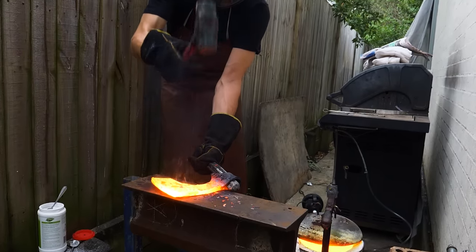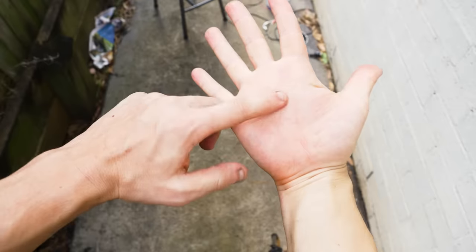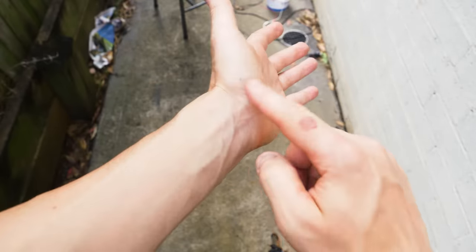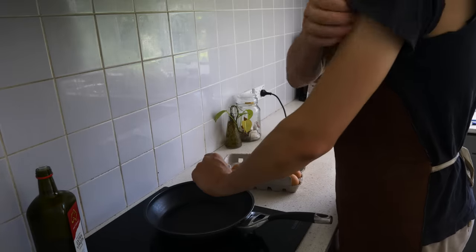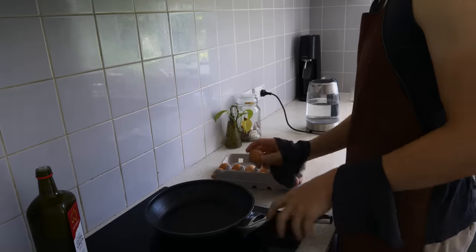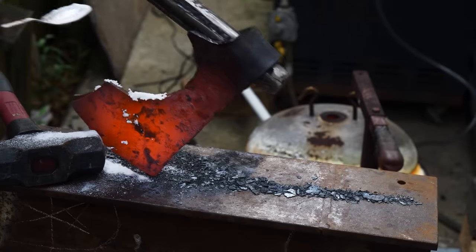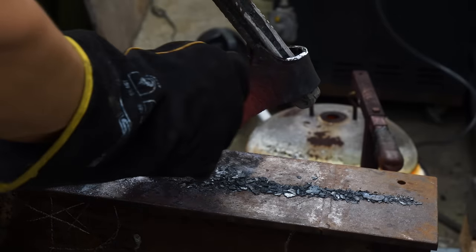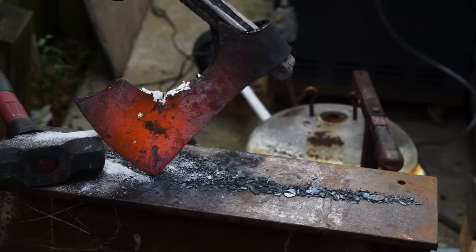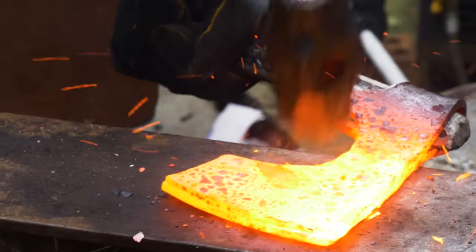Oxidation is the main thing that could screw me up as it prevents the two sides from touching and bonding. I found it super interesting that without any oxidation at all, metals will just stick together — for example, in space, if you get two flat pieces of metal and touch them together, they will cold weld. So if this hot welding doesn't work out and Elon Musk is watching, do you want to maybe help a guy out? The metal should be hot enough, so I'm going to give it a good pounding. I love blacksmithing — it's great. One little hot piece of scale gets into your shoe and it instantly melts through your skin. My arms are also covered in fun little micro burns. Someone needs to invent something to prevent this, like some kind of arm sleeves. I'm pretty certain I have a mean layer of oxidation in between the two layers. So I'm going to add more borax and just ignore it, and if it still persists, hit it some more with a hammer and hope it disappears.